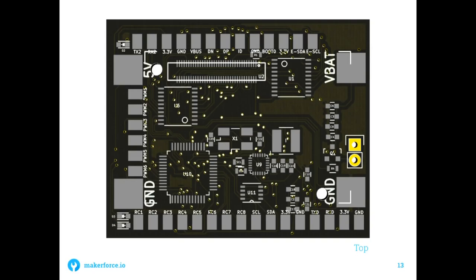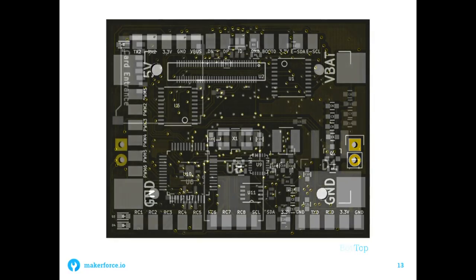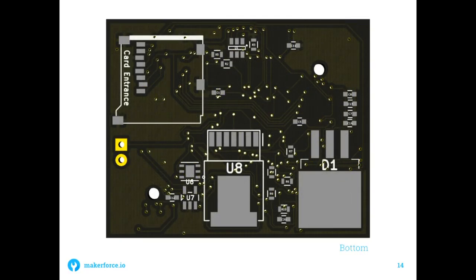This is a new board that we're currently implementing. It uses an STM32, so that's 32-bit, which will reduce the loop time and make things more capable. It also has a built-in power distribution system, so it regulates from the battery voltage straight to the servo voltage, allowing us to power the servos that drive the flaps.